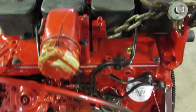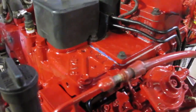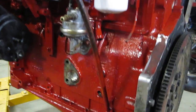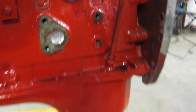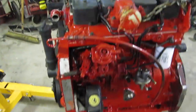If you're living in a cold climate, a preheater is not a bad idea — take that off the 5.9. Cut your plate shorter for your intake, weld the bottom shut, get it machined, get new gaskets and away you go. You're going to want to get all new filters and new oil. You're going to want to plug any openings with frost plug fill tubes that aren't necessary, and you'll probably want to set your valves.